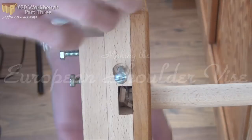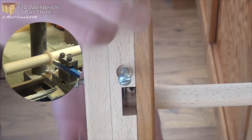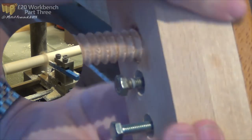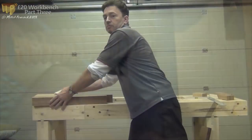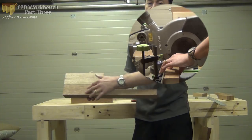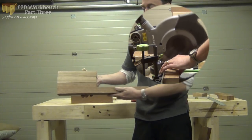If I couldn't make a pair of working screws the whole vise build would have been a waste of time, so the first thing I did was to make a pair of screws. As you can see I turned down the dowel from a piece of beech that I found and that seemed to work really well. The shoulder, arm, and jaw of the vise are all made from Meranti and it's just sandwiched together.